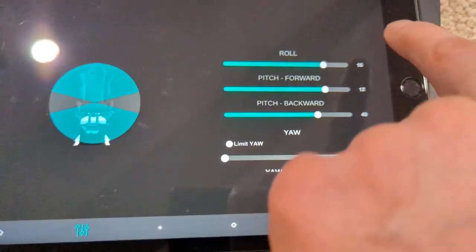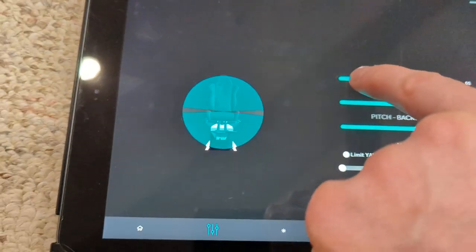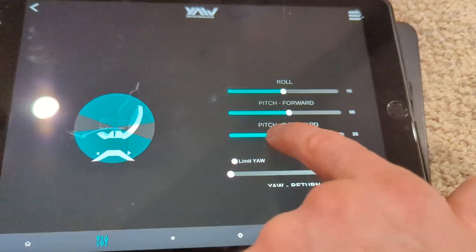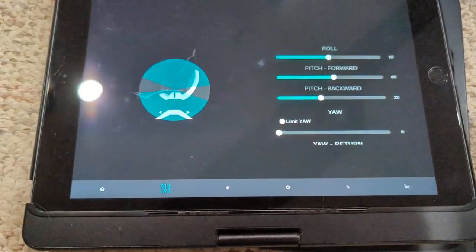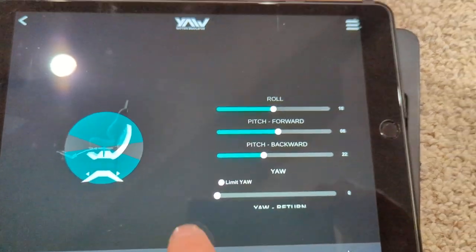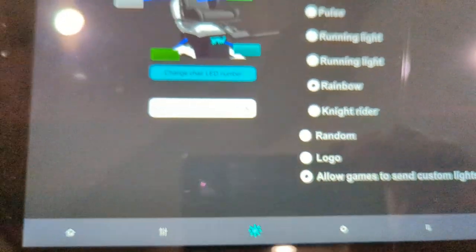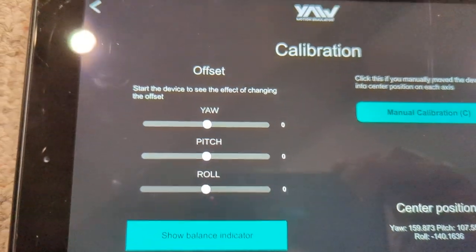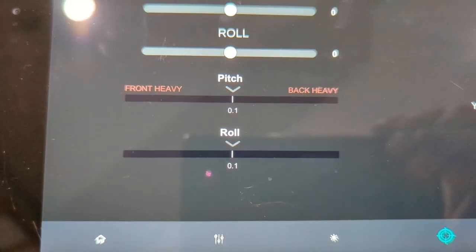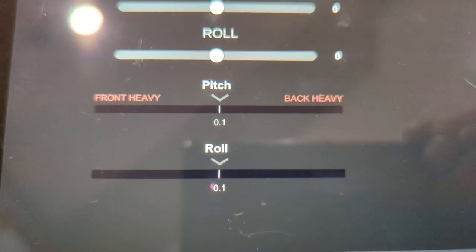Here are your limits on yaw and pitch - you can see how that slider moves, limiting the range back and forth, and you can do that for everything. When you start out, turn these limits down to the middle because you don't want the thing going to maximum reach right off the bat - in case something's tight in your build you could smack or hurt it. Limit it extensively, then gradually push your limits once you know what's going on. For calibration, I'll hit the balance indicator and it weighs itself - that's with my 45-pound homemade lawnmower weights on there.